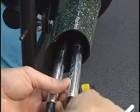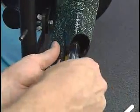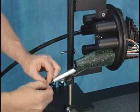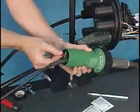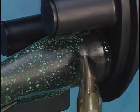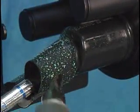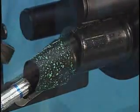For the oval port where two cables enter the port, install the branch-off clip and secure it in place with a tie wrap. Use a hot air gun and start shrinking the seal next to the base. Heat the seal near the base until the green paint turns black, indicating the seal is sufficiently heated. Continue heating the seal uniformly until it is shrunk completely around the base port first, then the cables.